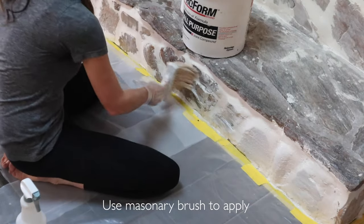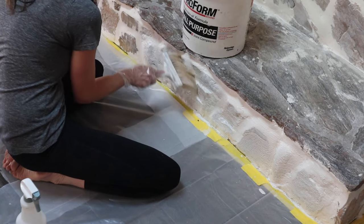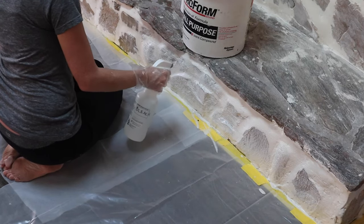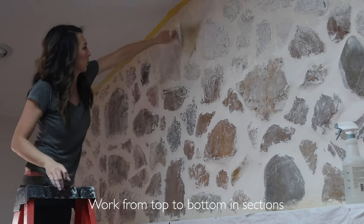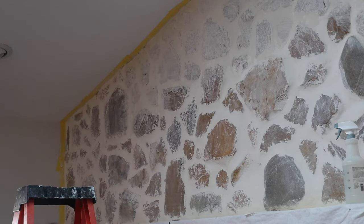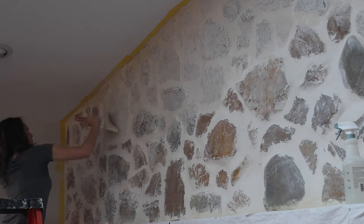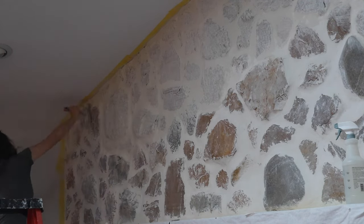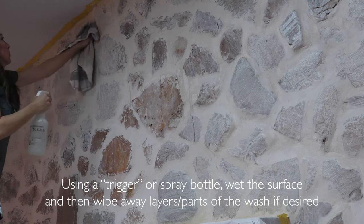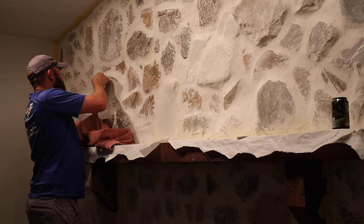You need to dampen each space before you put the lime wash on. Using a masonry brush, I put it on very generously because I didn't know exactly if I wanted full coverage or not. Here's the best part: after 20 minutes you go back and distress — take off as much or as little as you want. I'm not going after the entire fireplace at once; I'm going in a line from the very top because as I spray it, gravity takes over and brings it down, giving me more control on my distressing. This lime wash has fantastic coverage, so it just depends on how much or how little you want it to cover. I'm going back with my spray bottle and using my kitchen rag to go back and distress it — essentially removing it.